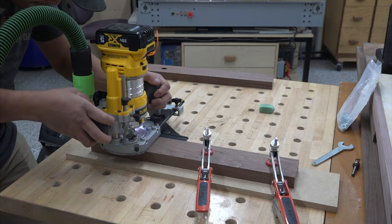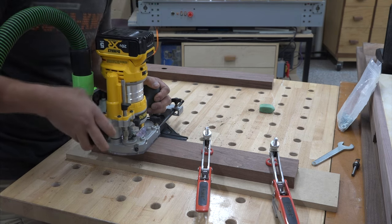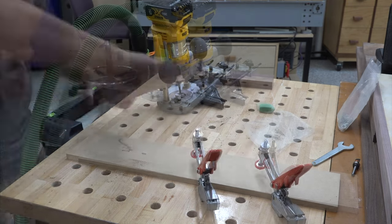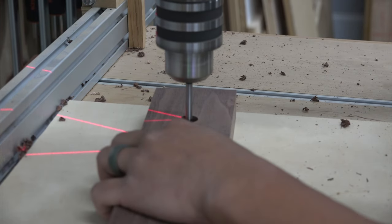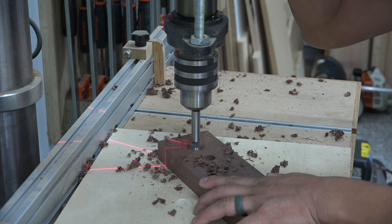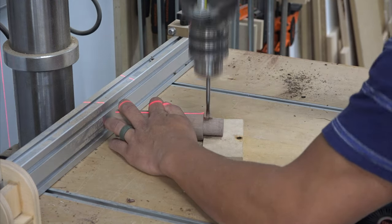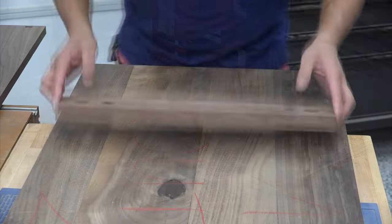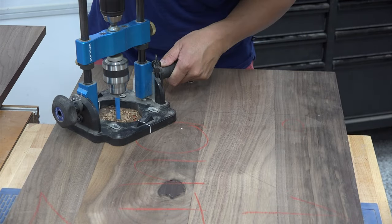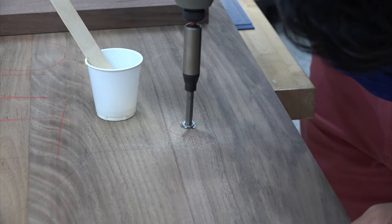The leg tenons will get wedged into a support block that will attach to the bottom of the carcass. To accommodate for wood movement I routed out an elongated counterbore hole along the back of the support, giving the furniture bolts plenty of room to move once secured to threaded inserts within the carcass, while the front of the support gets a regular counterbore through hole and is expected to remain stationary. I also drilled out the mortises for the legs and a strain relief for the tenon wedge, then created a saw kerf for the tenon wedge and cut out the wedges using a plywood jig. Once I located where I wanted the legs and support blocks mounted on the bottom of the carcass, I bore holes to accept threaded inserts, applied a little epoxy, and drove them in with an impact driver.